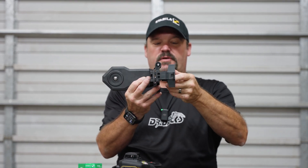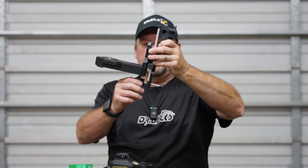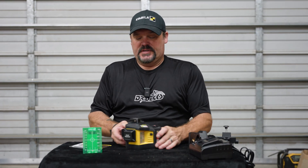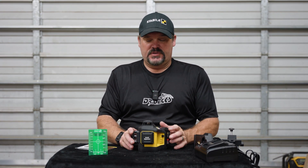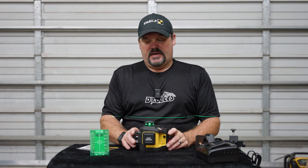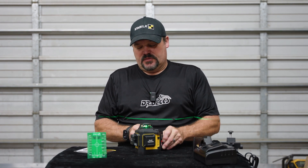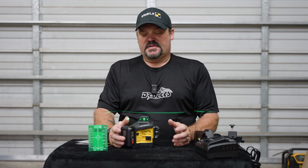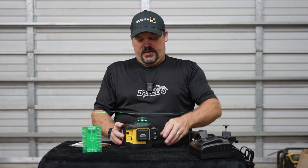The magnetic clip connects and this can attach to metal joists either horizontally or vertically. There's a twist mechanism that lets you adjust in and out to make sure you're within the four-degree tilt limit — this laser has to be within four degrees of tilt to work. There's an on/off slider switch, and the first couple times I used it I had to push firmly to get it to turn on, probably just because it's so new.